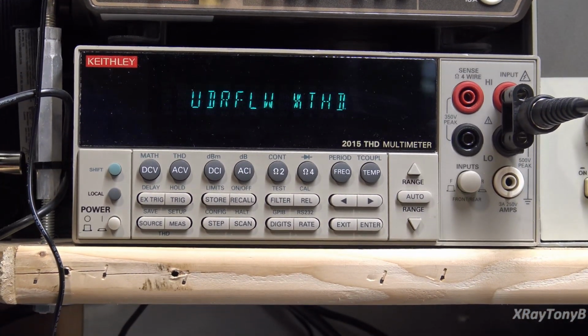All right, and I'm gonna bring it up. There is 30 watts per channel and climbing. There's 80 watts per channel. And let's see if I can get it to 90. There's 96 watts per channel. And there's your 121 watts per channel. It just starts getting up at that 0.1%. So for a 90 watt receiver, this thing is performing fantastic.